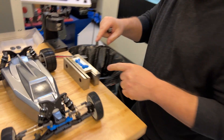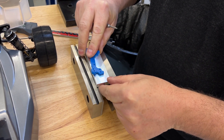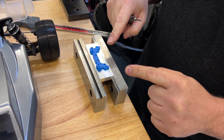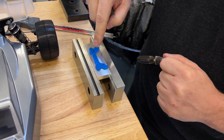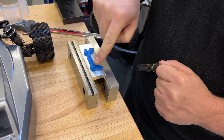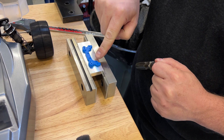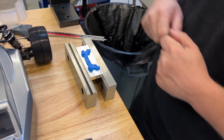Let's make a detour right here — you'll see I've got some parallels and this is kind of mocked up. This is a relatively thin piece of aluminum, and this setup will 100% work for side one. I could go in here and do all of the 2D adaptive, the 2D contour, all the drilling, all the tapping. These two holes up here at the front and this far outside hole are all M3 tapped holes. These holes on the inner perimeter are all clearance holes — through holes that are just three millimeter.